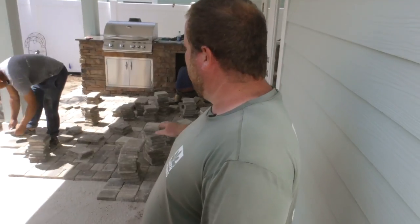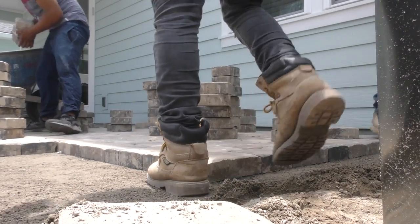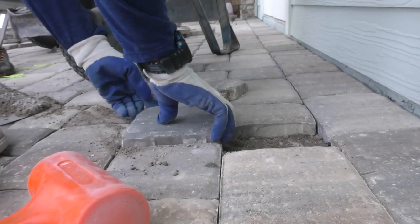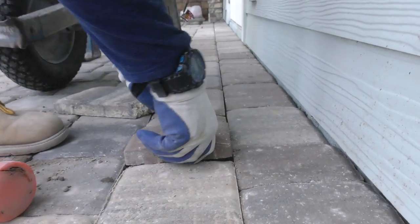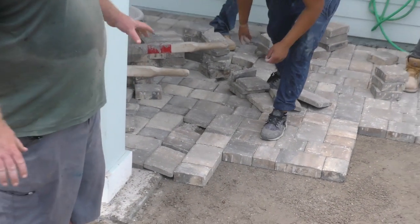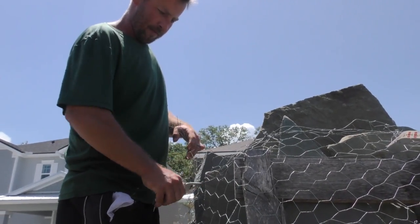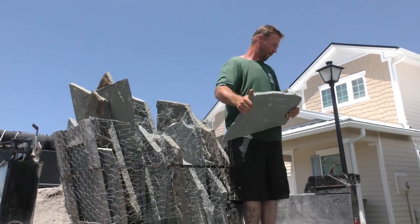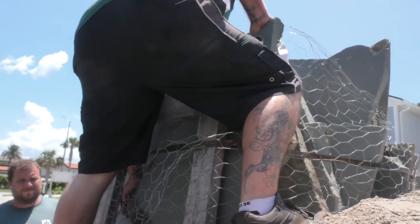Here in the backyard they had a concrete slab, so we're using the remodel pavers on top of it. Outside of the slab we're going to extend the patio using full-size pavers to transition into the remodel pavers. The guys are working on making that transition from remodel pavers to the regular-sized two-and-three-eighths pavers. They'll lift up those remodel pavers and float a little crushcrete underneath to make that transition. We've excavated the dirt on this side of the house and next we'll bring the crushcrete in, compact it, and start laying our flagstone and gravel.